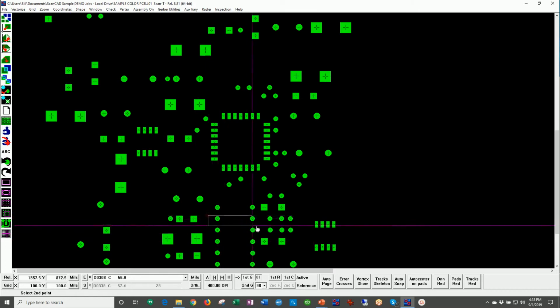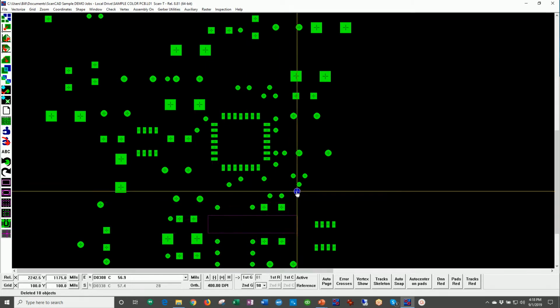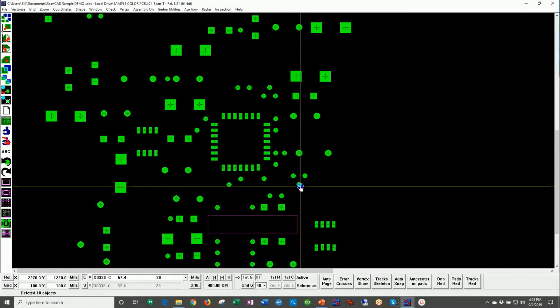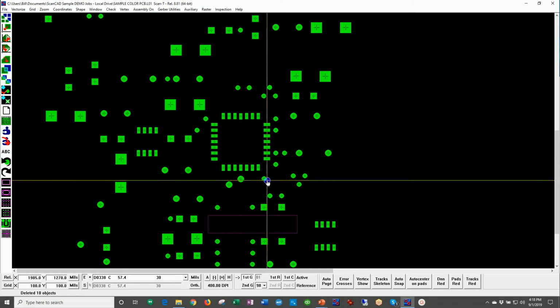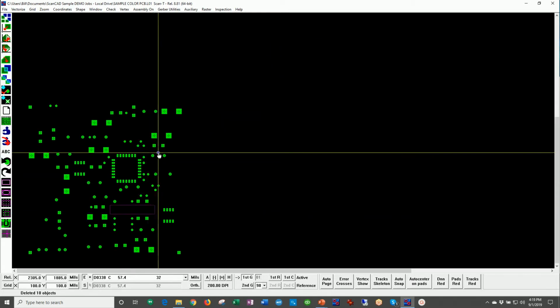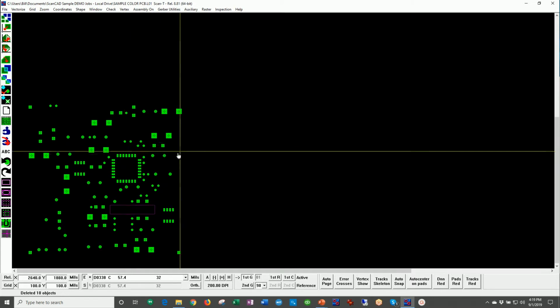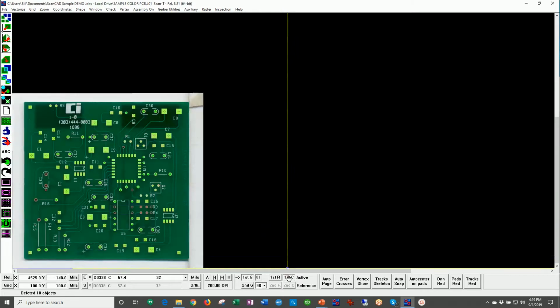Okay. You can draw windows and delete pads. You can turn your cursor into a pad shape, make it larger, for example, and you could replace pad shapes, replace, replace, replace. You have a full Gerber editor for deleting, editing, adding Gerber data, etc. Why am I sharing this with you? There's a very big benefit that I'm going to share with you in a minute.